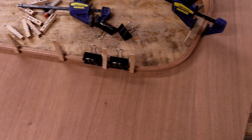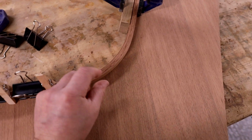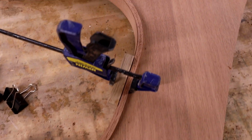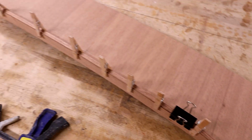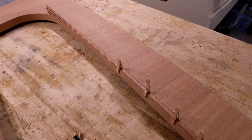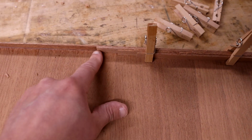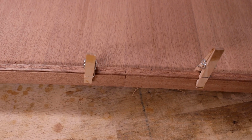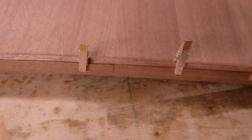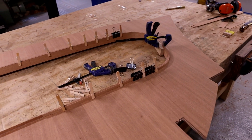Okay, so there's the first dry fit. This is probably still right on the limit of bending these, even though they're shorter sections, but managed to get them round okay, which is good. Nice tight lamination for the first half. So what I've done is I've staggered the 3 layers here, so that when I do the second side I can knit into those nice and easily. And I've marked the top ends, so I'll do the same thing there, trim them down to size, and then we can get that glued up.